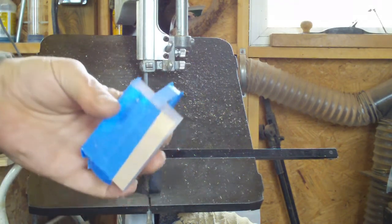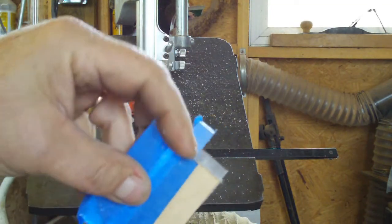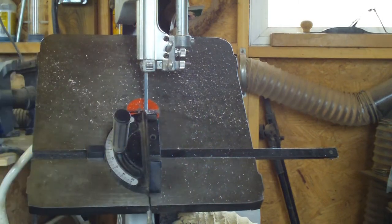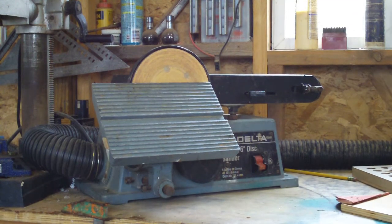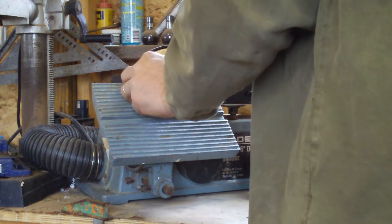Touch up on the sander to take the massive grooves out that a coarse blade does. The sander also has a tilt base, similar to the table saw, so theoretically this will line right up. As long as I'm very gentle with it, I can get the heavy scratches out.